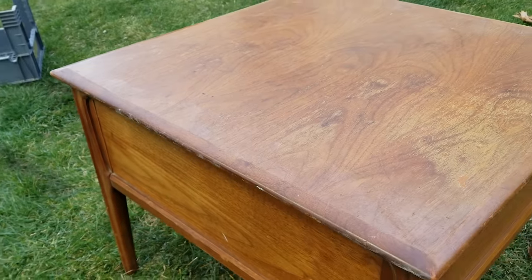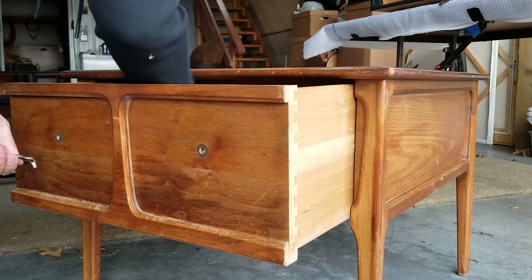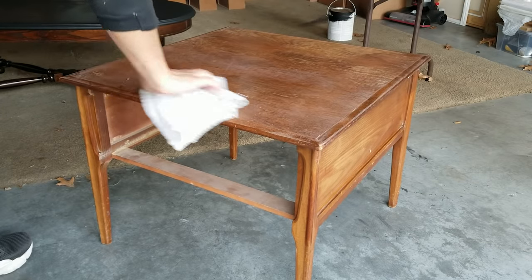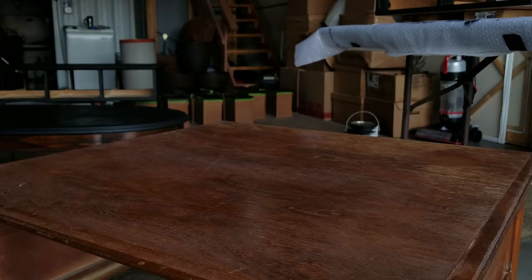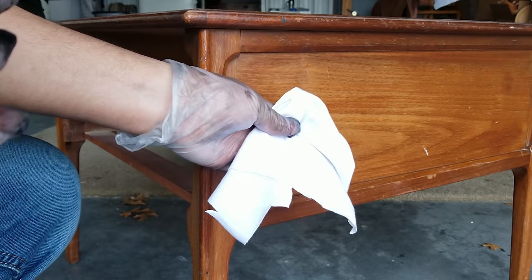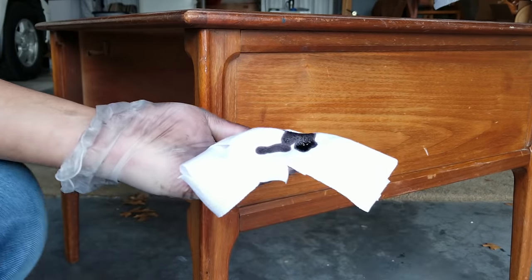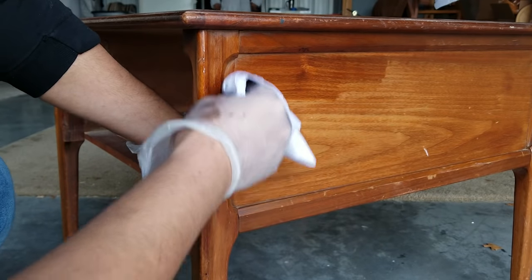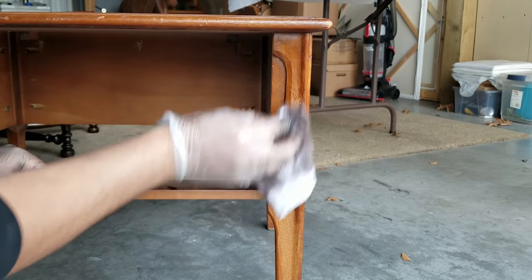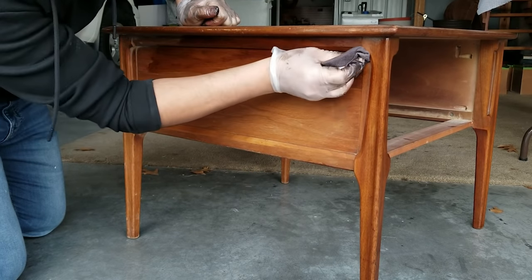This is the beautiful mid-century side table — it's in great condition; however, the top has a little bit of water damage and just some spots. The first thing I did is remove the hardware — the door pulls — and remove the drawers. Then I gave everything a good clean; luckily it wasn't greasy, so just some warm water was enough. Still not sponsored, but I'm using Howard's Restore-a-Finish. They come in a couple of different colors — I picked up the dark walnut because I think that's what this wood is. You want to use a lint-free rag and gently apply it onto the wood. Let me tell you, this is probably the most satisfying thing I have ever done — just watch it transform in front of your eyes. I highly recommend that you follow the directions on the can, wear gloves, and be in a well-ventilated area.